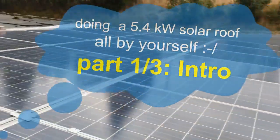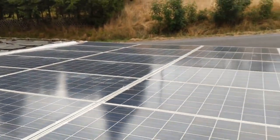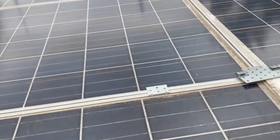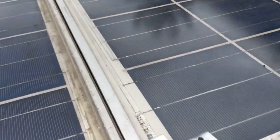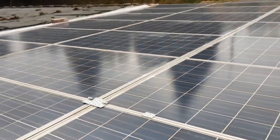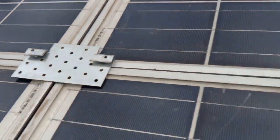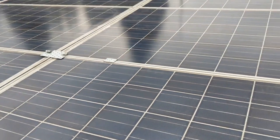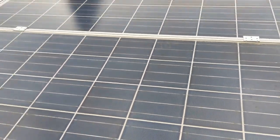I still need to make the intro or outro video on how to easily and cheaply make a solar roof. The key idea is the greenhouse foil below, which is the water-protecting layer. Here I had two-millimeter foam in between — this is not really very useful, there are always some gaps. For one solar panel you need two of these, and basically one of those, so they make up one euro with the screw and the foil underneath. I calculated about one euro for 1.67 square meters.